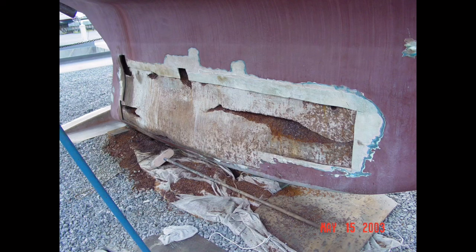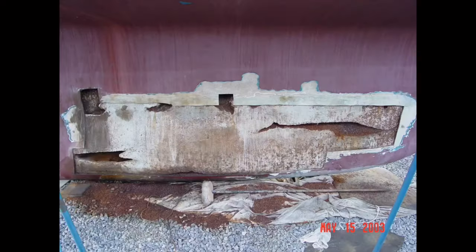The builder of this vessel has added bits of scrap iron, steel, and probably anything else he could get his hands on to add weight to the poured concrete ballast. Concrete is not very heavy, particularly as compared to lead. Once water seeps into the concrete area or the ballast from the bilge or possibly via hull damage, the metal scraps begin to rust and expand, causing the fiberglass of the hull to crack and rupture. The voids in the concrete indicate where the metal scraps are located.